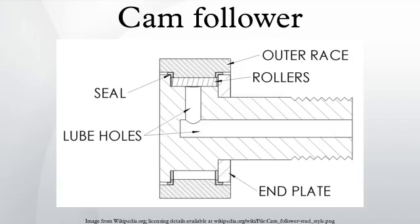The most common anti-friction element employed is a full complement of needle rollers. This design can withstand high radial loads but no thrust loads. A similar design is the caged needle roller design, which also uses needle rollers but uses a cage to keep them separated. This design allows for higher speeds but decreases the load capacity. The cage also increases internal space so it can hold more lubrication, which increases the time between relubrications.